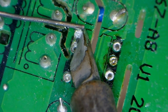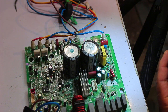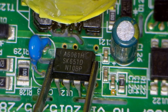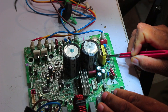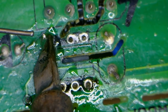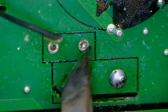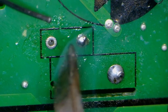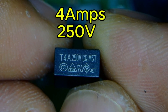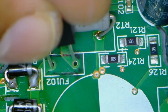I'll desolder these IC pins — both holes are cleared, and the rest of the four are also cleared. I will install the new IC here; the first pin is oriented this way so I'll place it accordingly. The IC has been placed in its soldering pads — let's push it down and solder it. Similarly, I am connecting these two linked points. I'll clean the fuse area, then install a 4 ampere, 250 volt fuse and solder it in place.